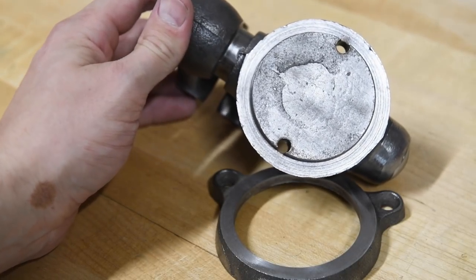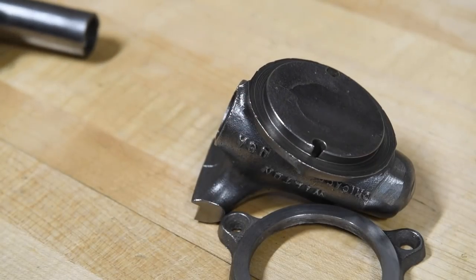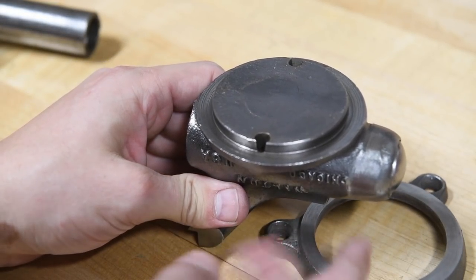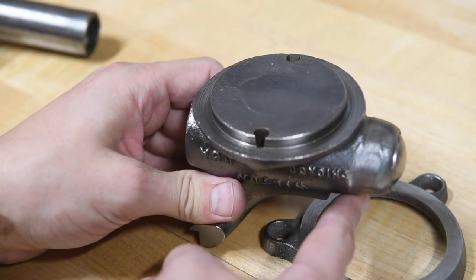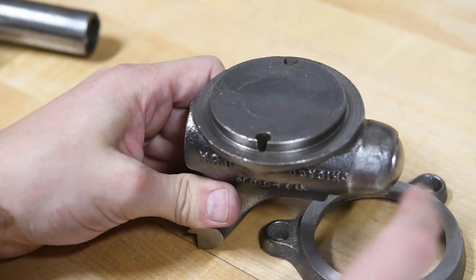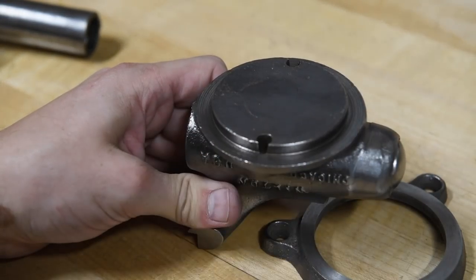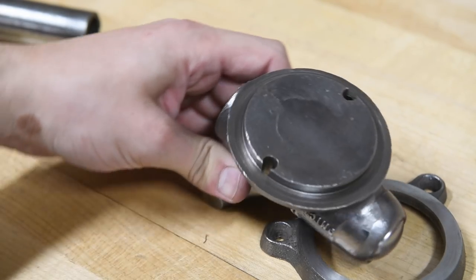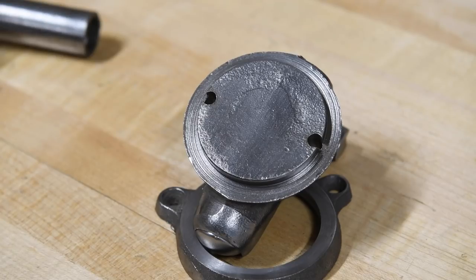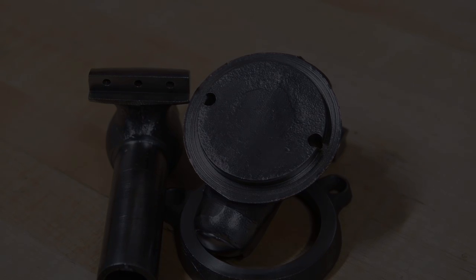I think the rotary table would probably be easier just because my four jaw chuck is big, but not humongous. But if we can get it supported on that end and kind of strapped down in the barrel and strapped down here, I can run a 3/8 end mill around, just cranking on the rotary table. So that may be worth doing, maybe not. I haven't decided yet. But anyway, that's our progress so far.